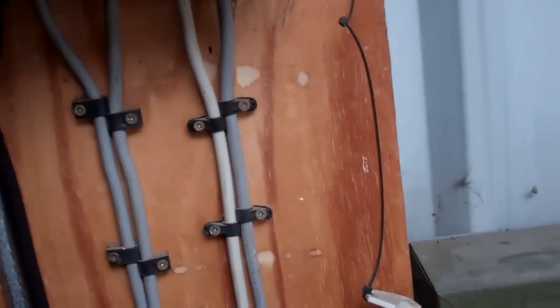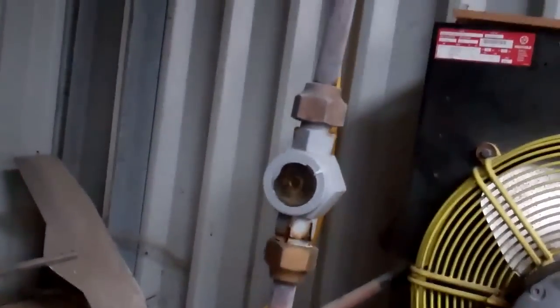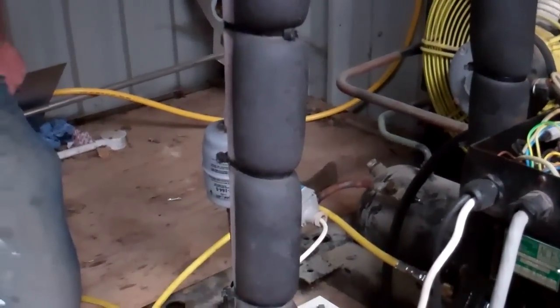I don't think we'll shut that off — it's off on the LP. Have a look at this: nice and warm here, frosty there — time for a new dryer. I bet that's full of crap out of the old compressor head. Cut it open.